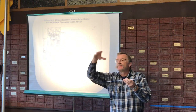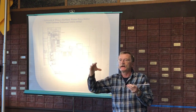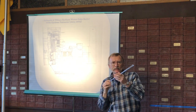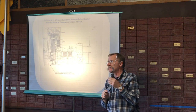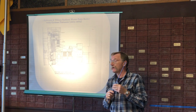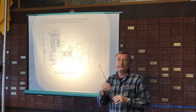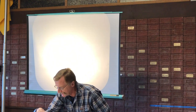You get much more efficiency with a fuel that is arguably more environmentally benign — it's still a fossil fuel, but these combined cycle plants are very elaborate. A poster on the wall shows a cross-section of both the combustion turbine and the steam boiler. Steam is still alive — steam is still keeping the lights on. In fact, on a bad water year in the Northwest, natural gas is producing about as much electricity as hydropower. On a good water year, you still can't beat hydropower for inexpensive power. Old versus new, and the new is still exciting and amazing.